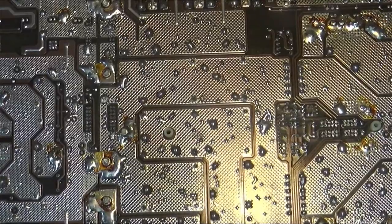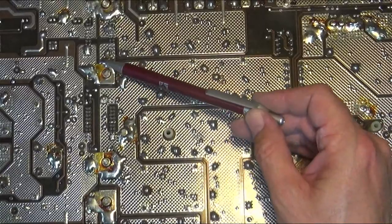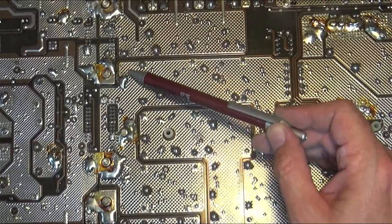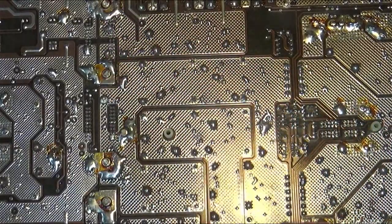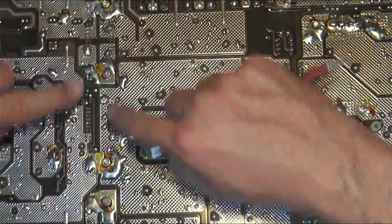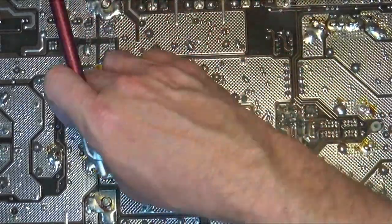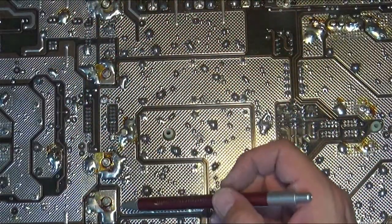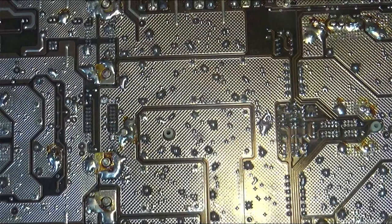You can see here where they've soldered this plate together right here. There's a line, the seam where the two boards go. These are the small pin connectors, and then they've got these big bolt plates for the rail voltages to go across. They soldered that together to make that connection more reliable, which I don't blame them. It is definitely a point that these boards could be unreliable, especially in a competition vehicle with lots of vibration.